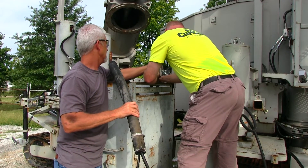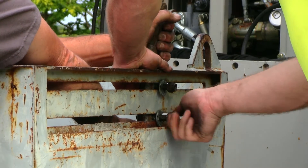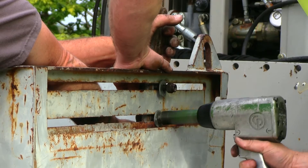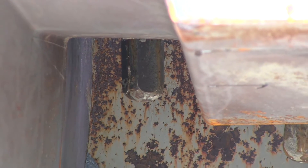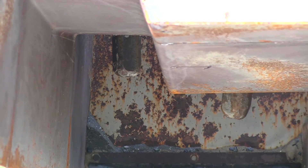The nuts of the top clamp should be on the outside of the hopper. Orient the vibrator so that the mount is towards the center. Position the vibrator so it is four to six inches from the toe of the curb. The other vibrator will be for the head of the curb — position it so it is centered in the head.